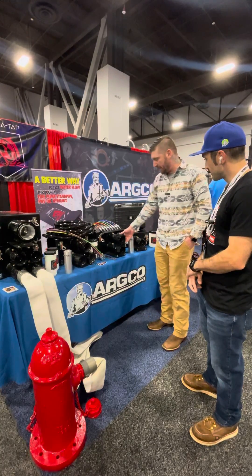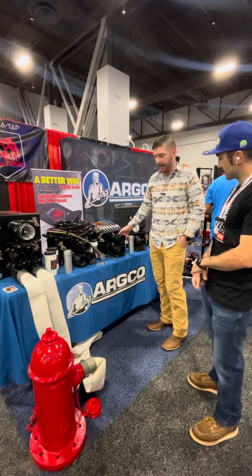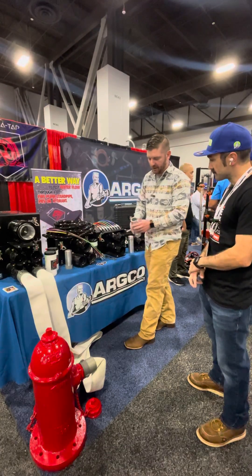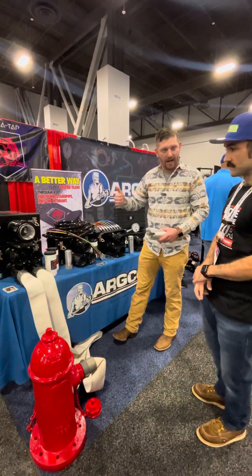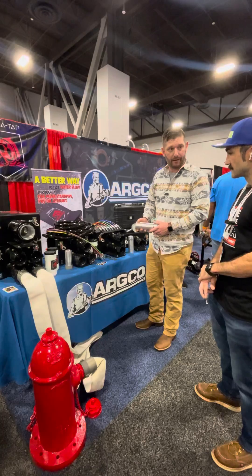We use Task Force Tip adapters — made in the USA. I think they're the best thing out there, and we're really happy with what they put in our hands. In addition, we've got reduced orifice inserts: this is an inch and three-quarter, we also have inch and an eighth, and then for the LDH we have three and three-quarter. So if you want to bump velocity to capture lower volumes, you can do that accurately and effectively.